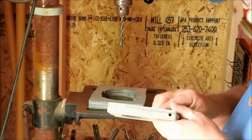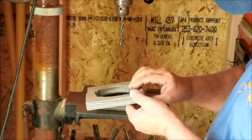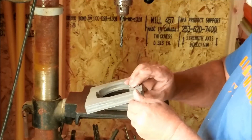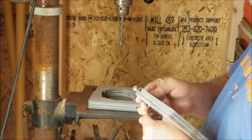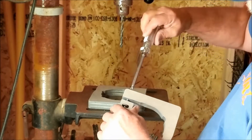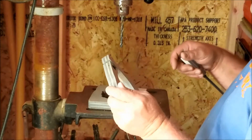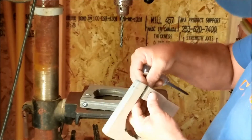With those drilled out, what I can do is take one of these quarter-20 welding tabs and a quarter-20 two-and-a-half inch machine screw, get it all in there lined up. And there's my router clamp. Now two and a half inches is probably a little bit long on this screw — I could probably cut it down some. So I think I will. But basically, that's it.